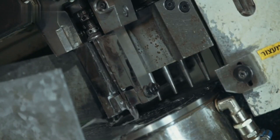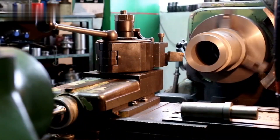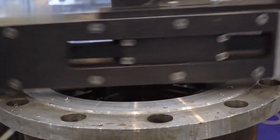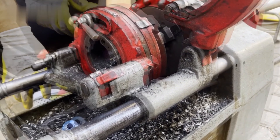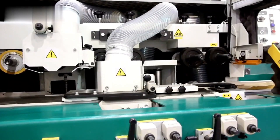After drilling, the inside of the bore is still rough, with tiny tool marks that could disrupt the bullet's path. That's where honing comes in. This stage uses abrasive stones or pads that pass through the bore, gradually smoothing it out. The goal is a mirror-like surface, so smooth that light bounces right back at you. Quick quiz: why does uneven bore finish matter for bullet flight?